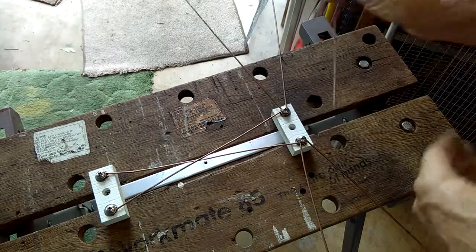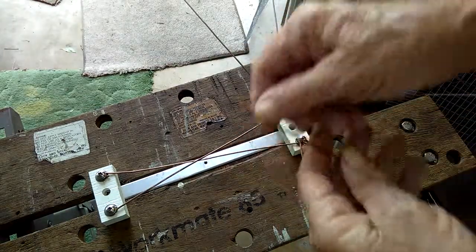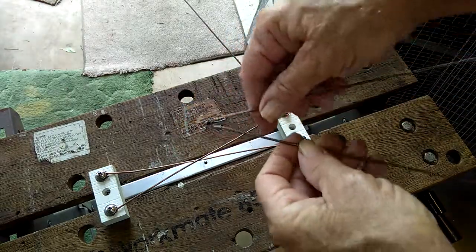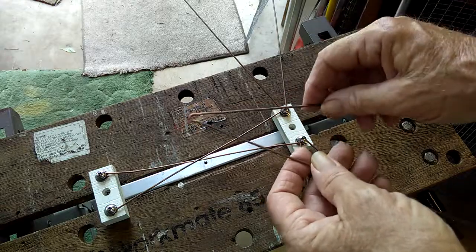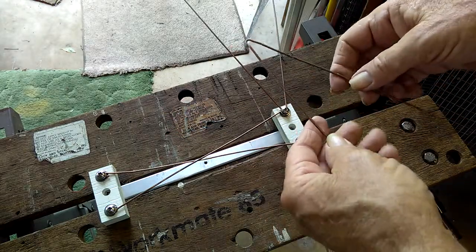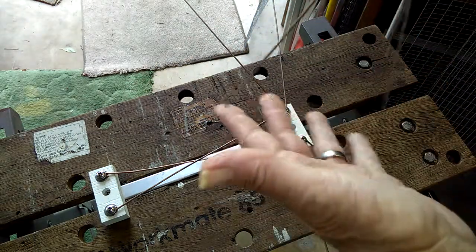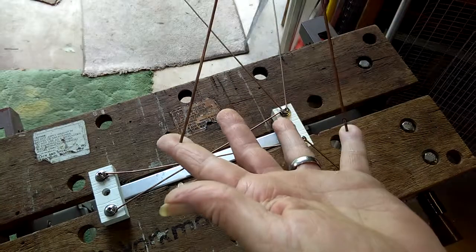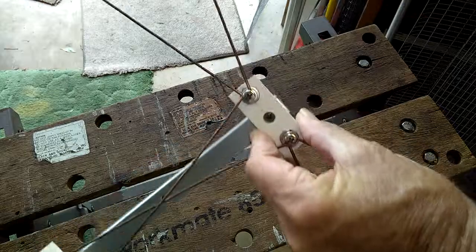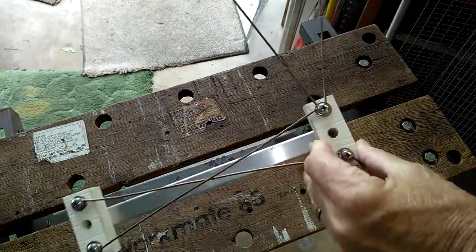They're 19 inches long to start with. You bend it somehow in the center, make a center mark, and bend it. Use a plier, use the post method I show in the bending video, and you want to have a 5.5 inch spread out here, end to end. You slide that under your screw, tighten it down, you've got a bow tie antenna.